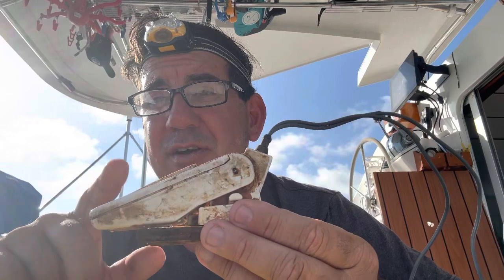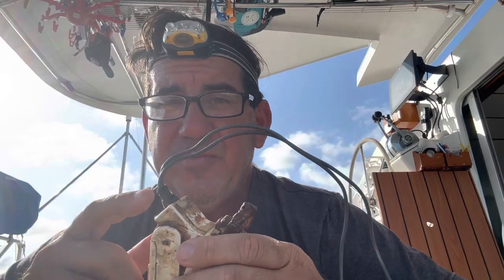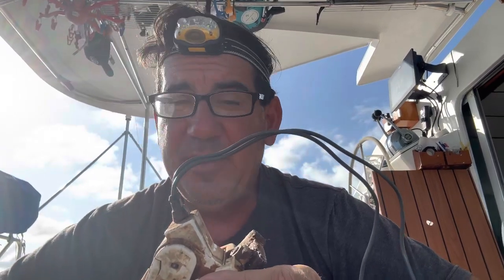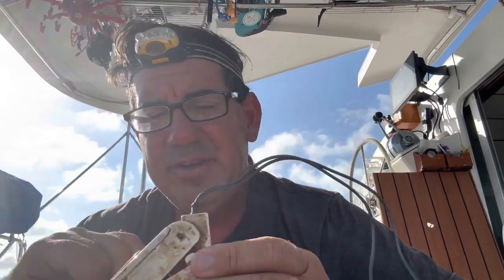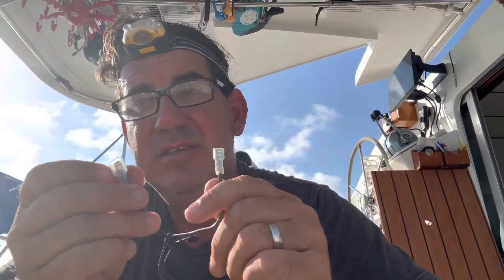What I found yesterday was the bilge pump switch was off but the pump was still running, cycling from full speed to half speed. When I went to pick it up, the back — the switch part — was hot, actually really hot. So I turned off the breaker to the bilge pump for overnight. Fortunately I probably could find this in town, and I have at least one spare on board. I'm going to take it off the brass hinge mounting plate, mount the replacement on there, and put some new quick-connect wire connectors on to make it easy to replace in the future.